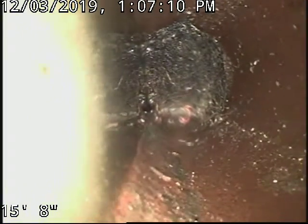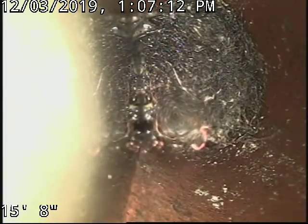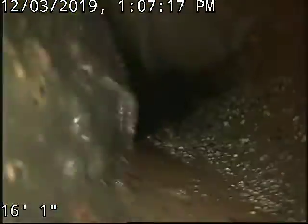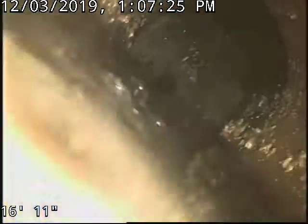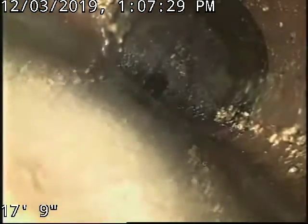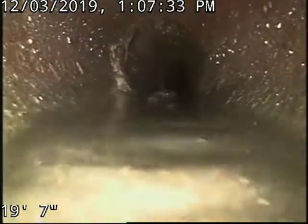Here's the bad one. The water has to go under this — everything they flush has to go under these roots right here, that's why it's bad. The camera goes right under it and this is where you get that blockage you see. We're going to try to get that out with the jet. You can see another area — roots right on top, and we go right under it.